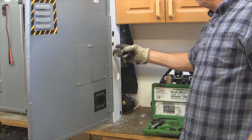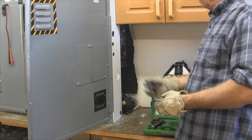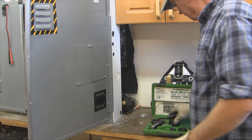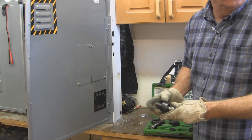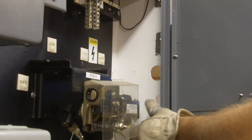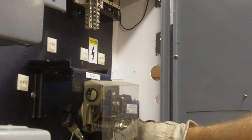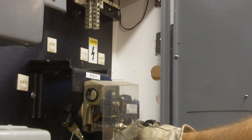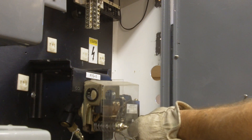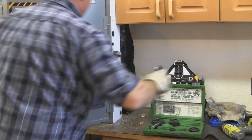In cutting these, the one thing I wasn't paying attention to — and it's a good lesson learned here — is that you have to know what size hole you're going to cut and account for your distance. Rather than doing the half-inch or inch and a half, I'm going to drop down to just a one-inch to show you. That's the one I drilled with the 7/8 unibit. Sometimes it takes two people to get this in. So this can also determine what tool you're going to use — a hole saw, a knockout set, unibit, whatever. We'll go ahead and crank this on out.